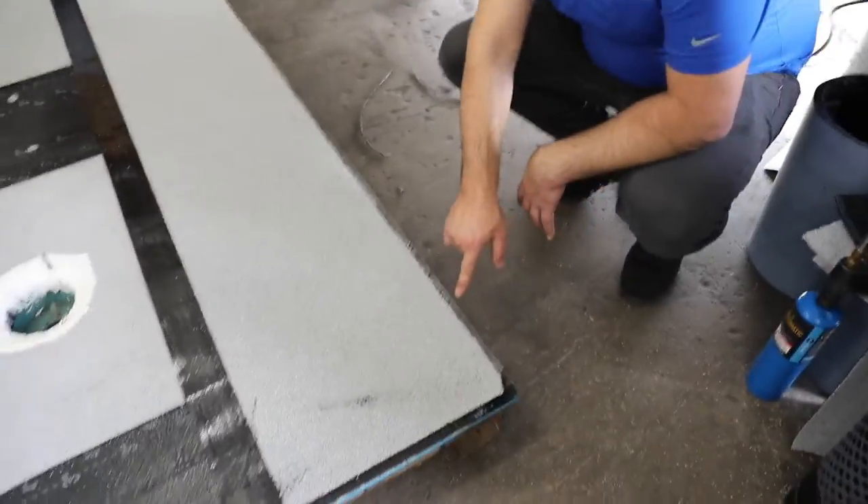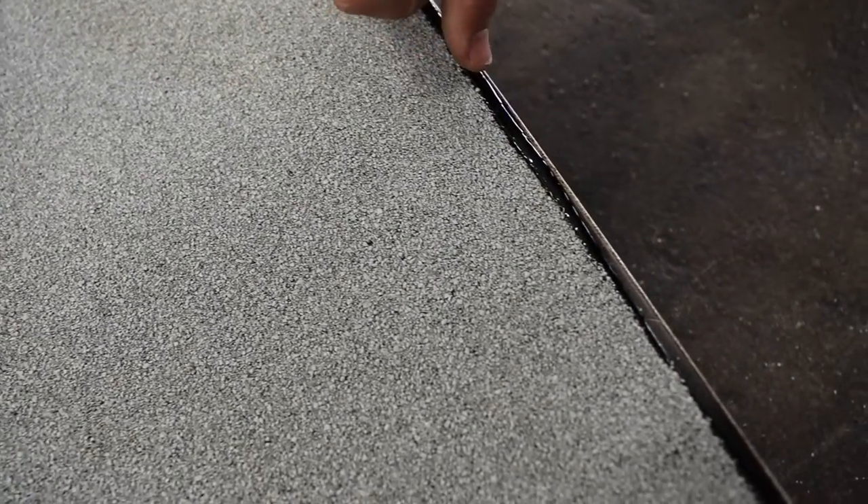You can see here — this is really what we're looking for: about a quarter inch of bleed-out along the seams, filling up that edge between the low-rise flashing and the roof itself, creating a nice, seamless roofing project.